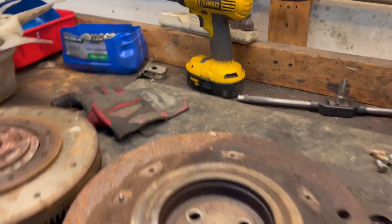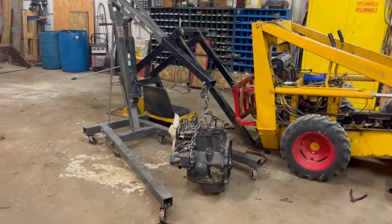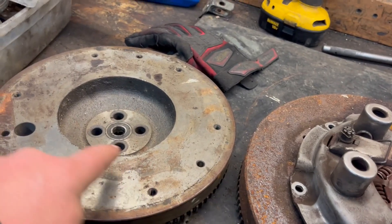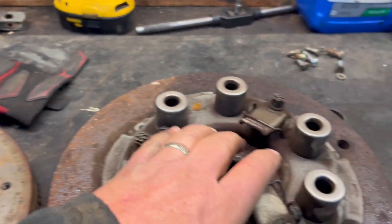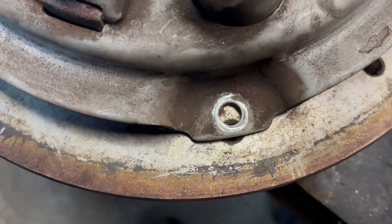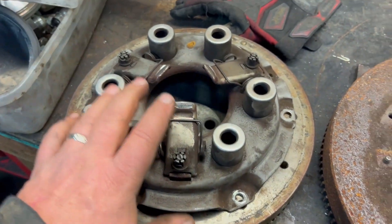Here's another issue. This is the clutch that came off the original machine — here's the flywheel from the original engine, and here's the flywheel for the replacement engine. These flywheels are not interchangeable. The bolt pattern is different, and the diameter of the flange on the other side is different. The clutch does not bolt up to this flywheel. It's very close — that's how close it is — but the bolt holes are in roughly the right position, just at the wrong diameter for this pressure plate to work.